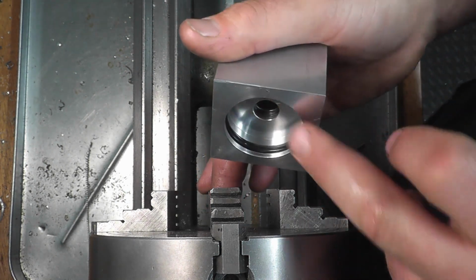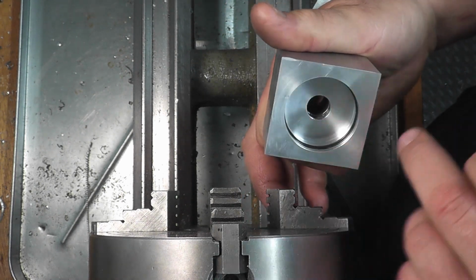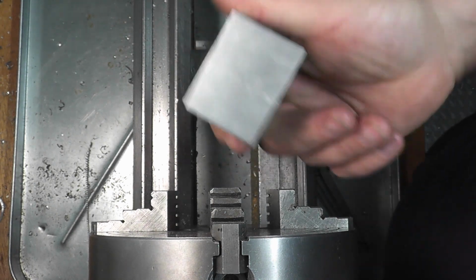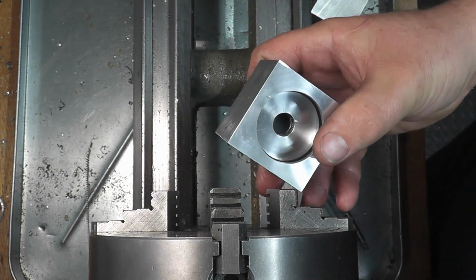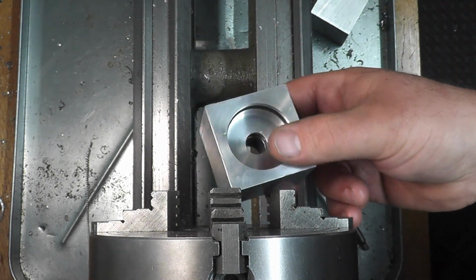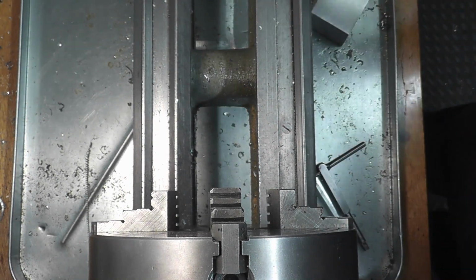And there's another O-ring groove in the little 1/2-inch bore in there. And I set this up with a piece of that rod in here and the tube in place and some water, and it held the water overnight, didn't leak out. So there is a seal, I just don't know how it'll act under pressure. So if for any reason this doesn't work, we'll just have to make another end cap, but we'll make a few changes to the way we do this one.